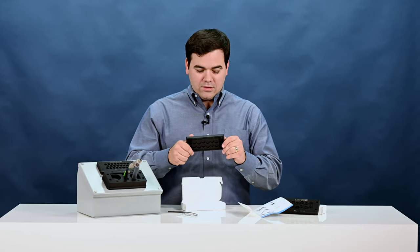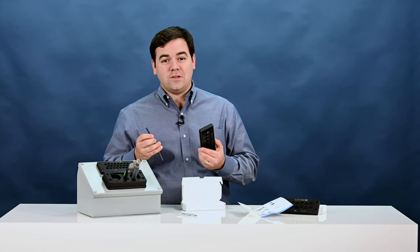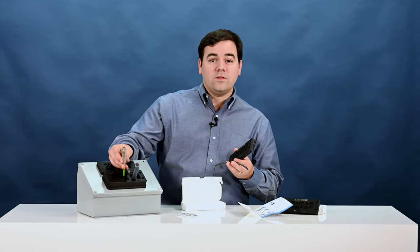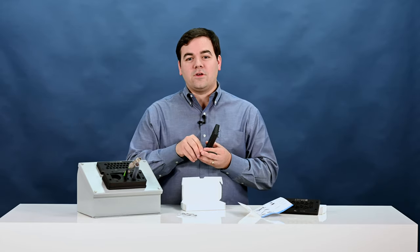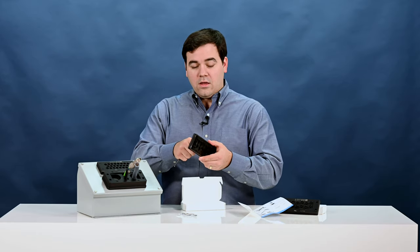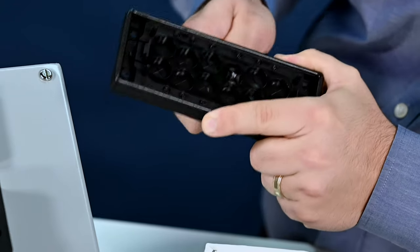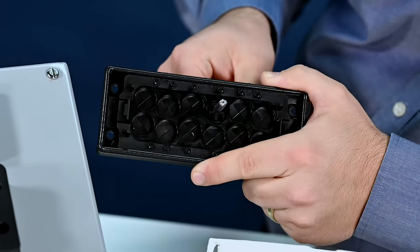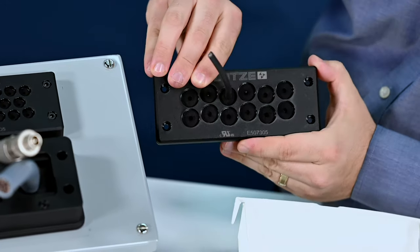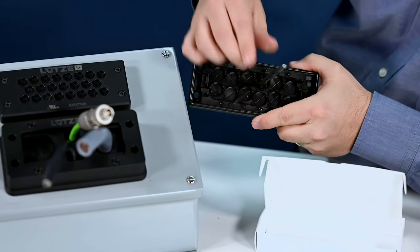One of my favorite features about this product is what we call the X seal — it's called CableFix X for a reason. The way this product works is all the cables are pushed in from the front. Now if you have a cable like this one with an M12 connector on it or some other connector, as long as you have one end flat cut, you can still push that cable through. What happens when you do that is you press through the membranes inside this product and you actually open up this little X right here. That X allows your cable to pass in one direction from front to back, and when you tug the cable forward, that X closes right up. That's going to create a seal that achieves NEMA type 4, 4X, 12 and 13, and give you a little bit of strain relief there as well.